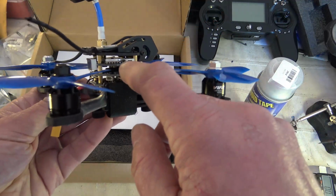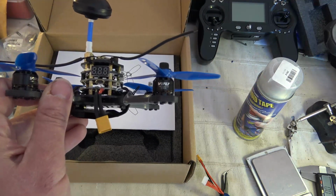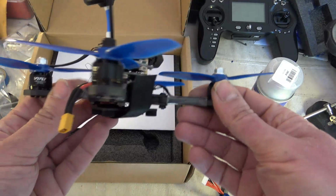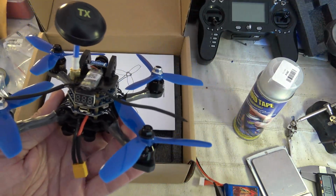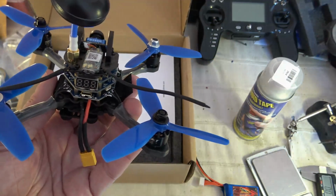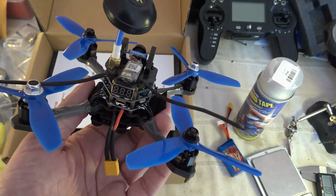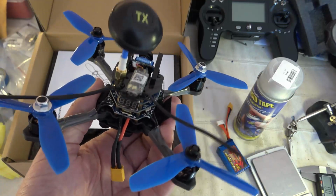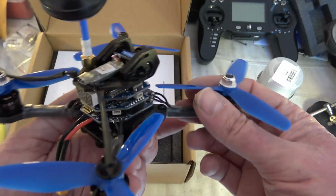If you long press more than 3 seconds, you will be able to select between P01 25 mW, P02 which is 200 mW, and P03 the 600 mW output power. So if you need a lot of power in a wide open space, that's great. The FrSky receiver is installed here, on top, where you have this small bind button. And good news, they flashed the XM Plus firmware with RSSI compatibility on the last channel. So it means that on your OSD you will have your RSSI feedback. It's great.